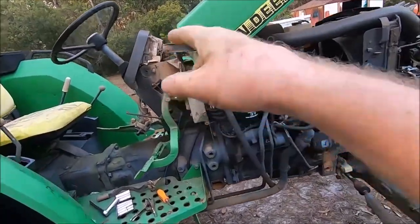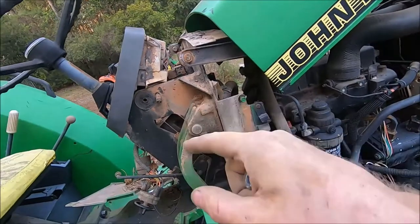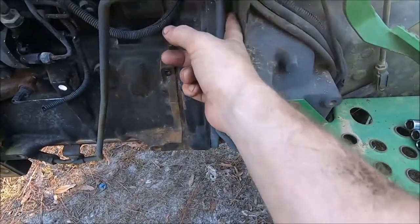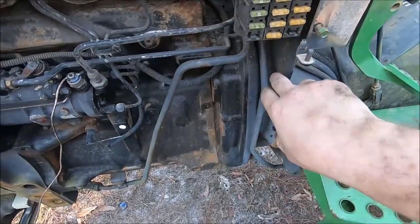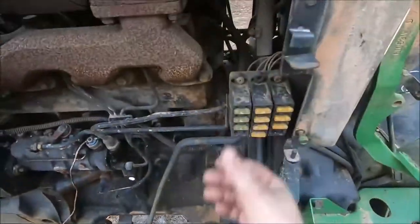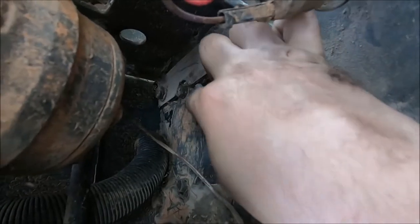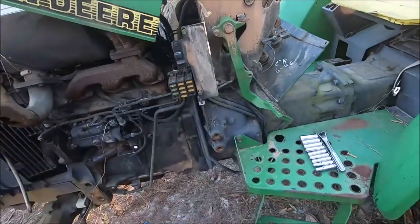While we have this apart, we'll look at both the battery drain and the fuel shutoff solenoid starting issue. There's not much to prevent you from splitting this tractor — on each side there's a bolt and a mostly decorative plate that blocks it off. You take those plates off and the fuse block, then you can access the transmission bolts. There's also an access plate on top with two bolts — one on each side — that gives you visibility for adjustments if needed.